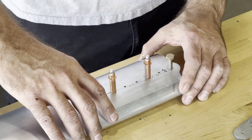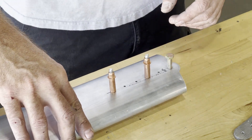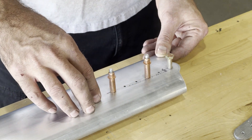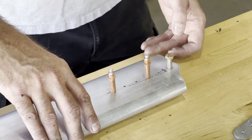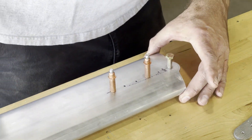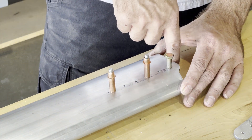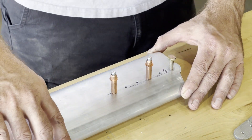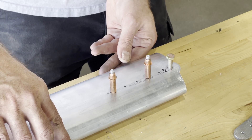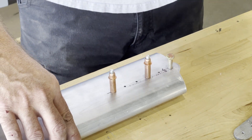I don't think I want to hand drill these. I'd like to go ahead and set this up in my drill press. That way I'm certain that I'm getting perpendicular drill holes through the lift strut and the doubler. Ideally I could 3D print a cradle with an airfoil shape. I'll use this hole where the bolt is - I'll run a drill through here to index it for perpendicular - and then I'll clamp some parallels to the drill press table and find a way to hold this in that position. Definitely want to do this on the drill press.